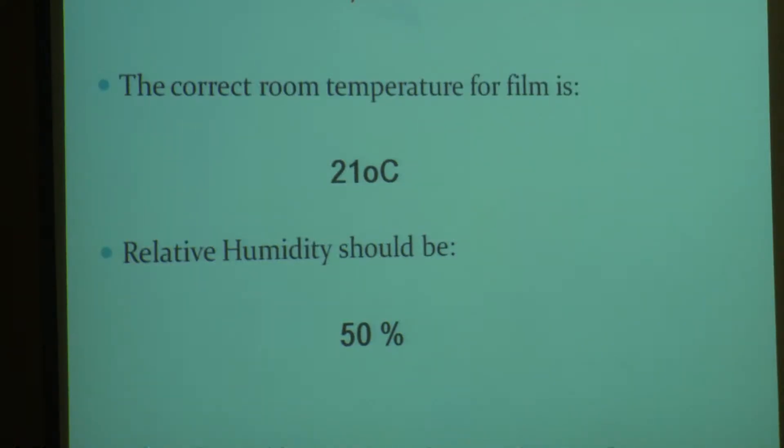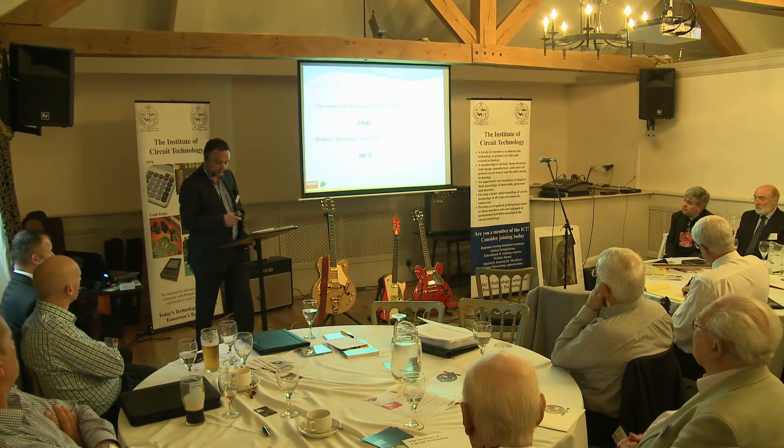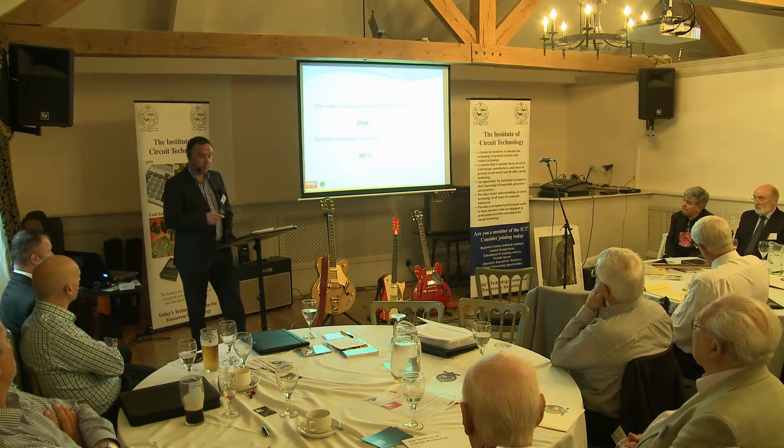With the photo tool being at the very beginning of the manufacturing process, we have the age-old fact that if the film is out, then the board will be out too. On my travels around the country visiting many PCB shops, I've found that most, if not all, plotting rooms do have air conditioning controlling the temperature, but the same cannot be said for humidity. Once the plotter is set up, the engineer has been in, it's all working, the processor is chugging away — it's very easy to forget the environment that the film is now being used in.